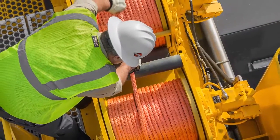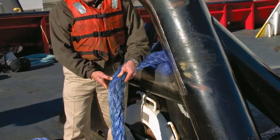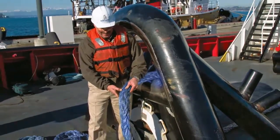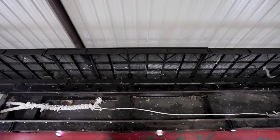The problem is that there is no common standardized language or reference scale to describe the state of a rope. To date, judgment on the state of the rope has required a synthetic rope expert to complete an on-site inspection. The alternative is removing the rope from service and testing the rope to destruction in order to evaluate residual strength.